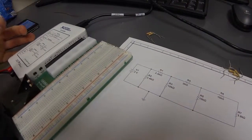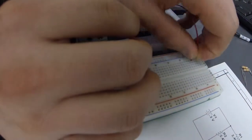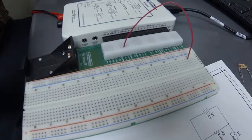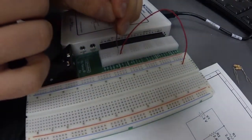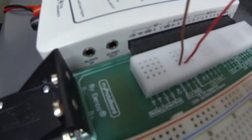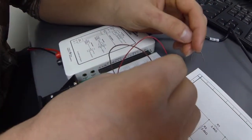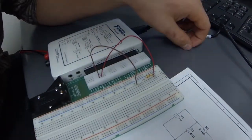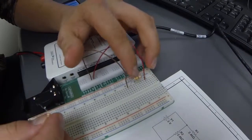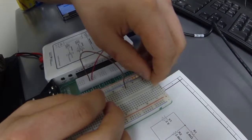The first thing we're going to do is wire this up. This is going to be our voltage source, AO0 — we'll place it up here. We also need a ground, so we'll ground this and stick it in. We're going to start with a 2.4 kilohm resistor in parallel with the voltage source, and then from the same node on top, another 2.4 kilohm resistor is wired to it, placed off in the distance.